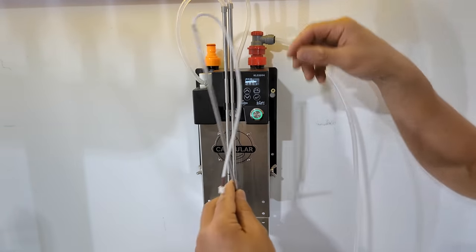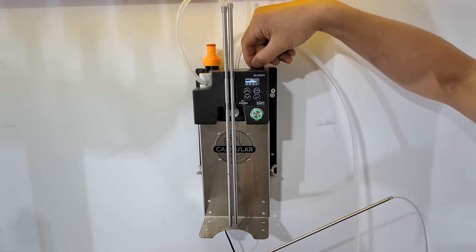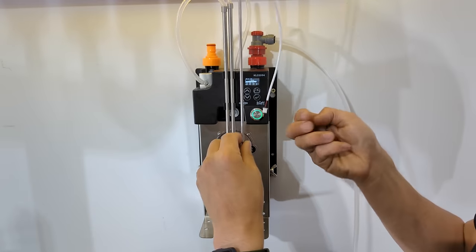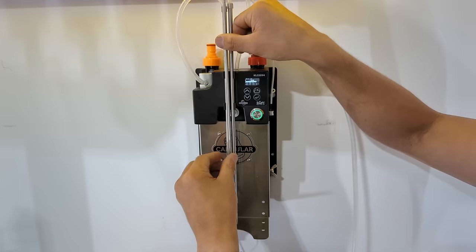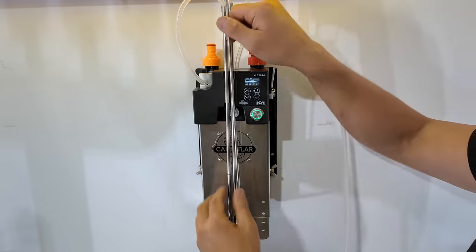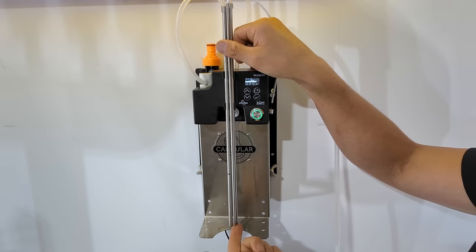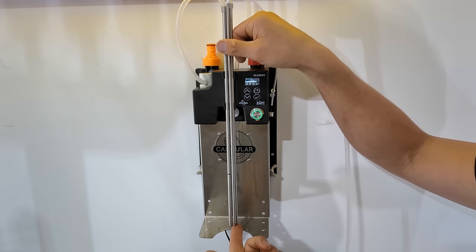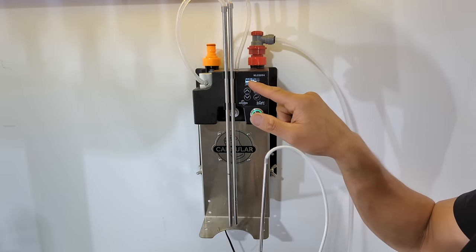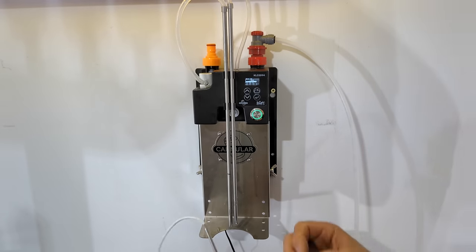What you would have to do is open up the casing and push the probe through this little grommet hole in the top of the machine, and pull that out like that. The cable would feed through the hole and you'd plug that in, and this third probe would secure the other two. So instead of just having liquid and gas on the front there, you'd have liquid, gas, and also the temperature. As you're filling into the glass, it would read the temperature on this probe. We'd try to make it as instant read as possible, and that data gets fed up through the display here and then up to the web, so you can track the temperature of the beer for that filling run that day.